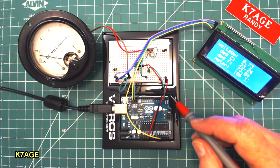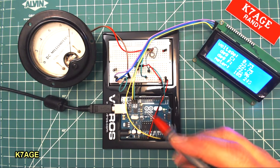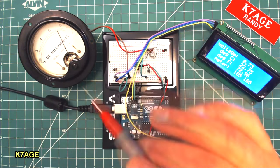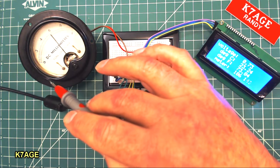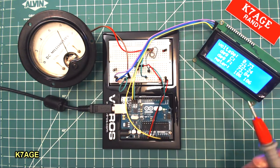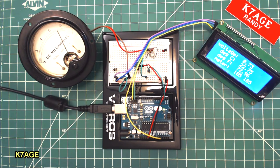In my next video, I'll take a look at my analog thermometer project. It uses a couple of aspects of the Uno board: the analog-to-digital converter to measure the temperature voltage coming out of the temperature sensor, does a little bit of calculations, and then uses the PWM — pulse width modulation — output to drive a milliamp meter. I scale the temperature measurement so it scales between zero and one milliamp on the meter, displays the temperature for five seconds, then ramps up and down. I've also interfaced a four-line display to show the values within the software.